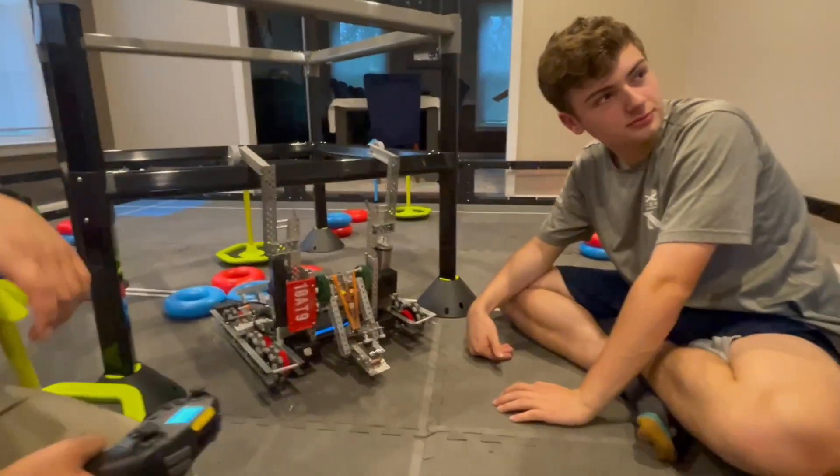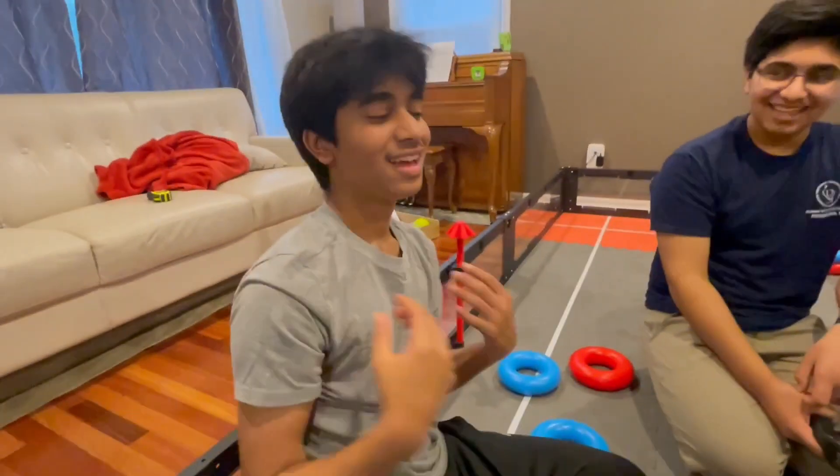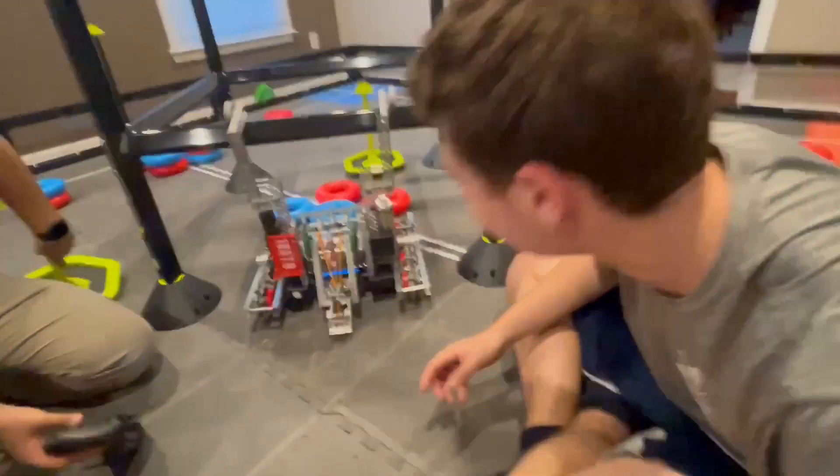Robot in three days. One more tip if you plan on doing a robot in three days — if you have the sanity — please make sure you have the materials you need beforehand and that they're not bent or destroyed. We rebuilt the chassis three times because of bent materials. The person holding the camera used stuff without reinforcing it so it got bent, and we only had bent C-channel and had to rebuild three times.